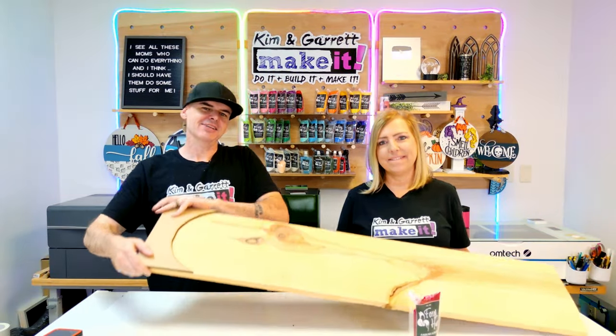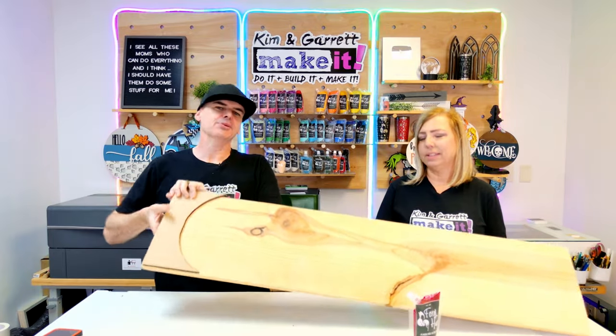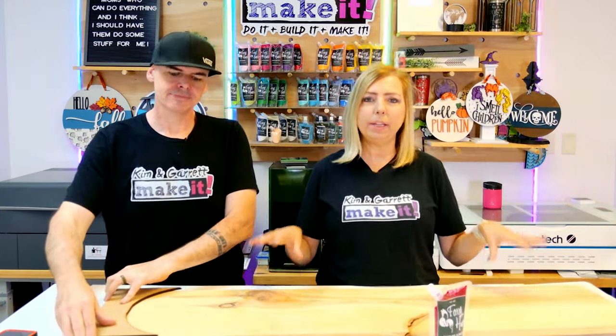When I was cutting out our turkey, I cut out a little template that I'm gonna use to lay on this 1x12 so that we can draw a little arch and cut it out with the jigsaw. This is a little different — usually we use a full 1x12x4 foot board, but because we want a turkey head and turkey feathers, we really feel like we should round the top of this, kind of make this his turkey body. You can make this kit without that and use a little paint to do some hiding, but we're going to show you what it looks like if you do round the top.